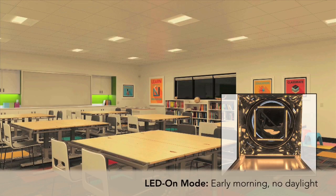The out-of-box functionality of the LightFlex LED with Enlite controls is sufficient for most commercial applications. The LightFlex LED follows a 24-hour cycle. For example, in the morning before sunlight is present, the louver is going to be closed and the electric light will be at full bright — the LEDs will be at full bright, and the louver is not open to prevent light bleed out of the building.